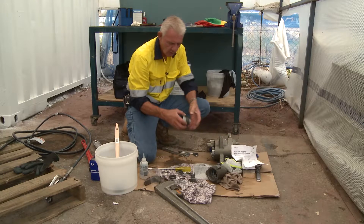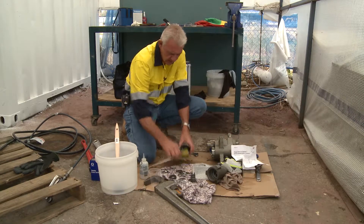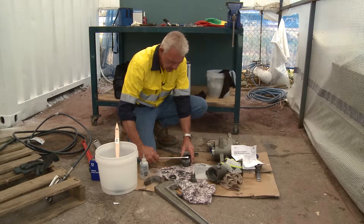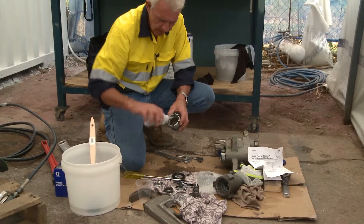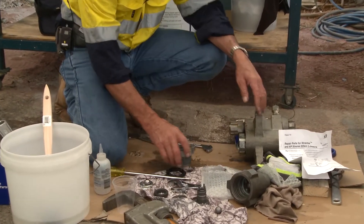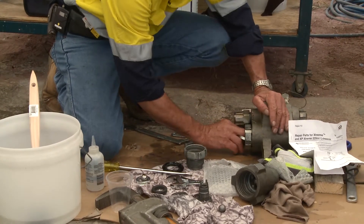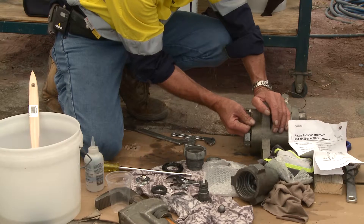This is what I was talking about — a castellated nut. It's actually a well, and inside the well is where the oil sits. The separating oil sits in this well — that's what it does — and it lubricates these top packers, so they're actually wetted all the time. Here's the retainer, and inside here is the remainder of your packings.